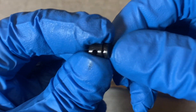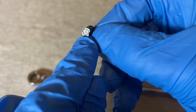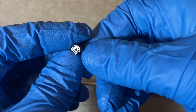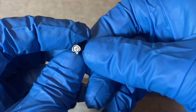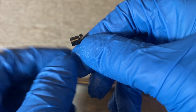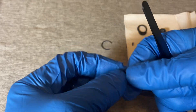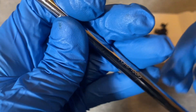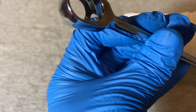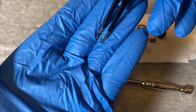Here is the switch. Underneath it has kind of what the bat wings have - that little point there that keeps the switch in place from left to right. On top it has the hole for the plunger, and here's the cutout you can see in profile - that cutout is for the security plate that sits in there and keeps it from moving forward. Last but not least, there's a plunger in a kind of weird spot - a small plunger with a spring in it.